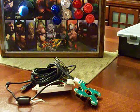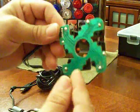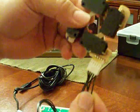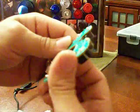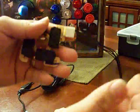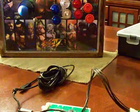As far as a joystick, this right here is the big part — this is where the joystick would go around in circles and push buttons. These little switches here, it's a very simple design. I figured it out real easy. Basically these five wires that you can see here: one of them will go to all the buttons, which is your comm — the little switches all have a comm on them. It's real simple, it's the top one, and the other ones are your up, down, left, right.